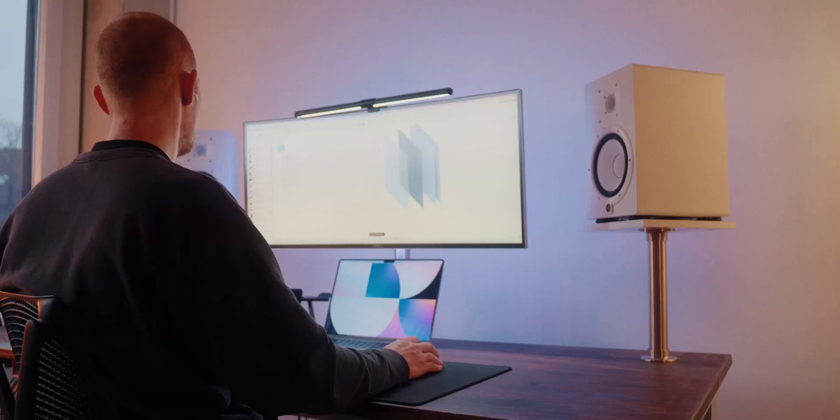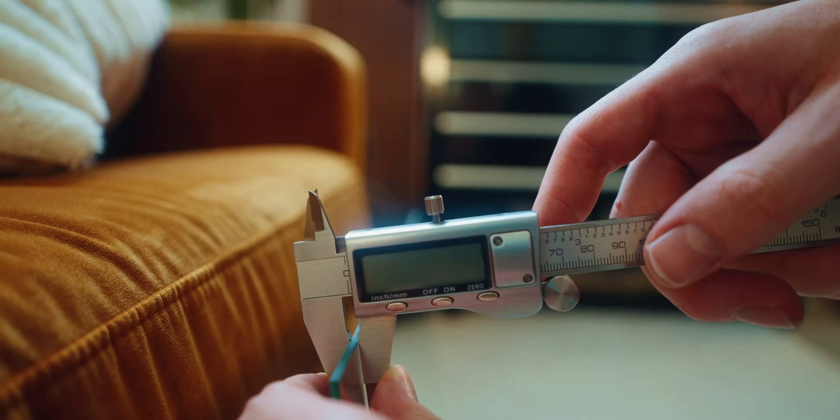So let's get to designing. I'm designing this whole thing in Fusion. First I measured the mirrors that will be on the outside — they are 40 by 40 centimeters and 3 millimeters deep. The problem is that for a perfect cube, every edge would ideally be at a 45 degree angle to join really nicely, and they're not. Also, I only have four of these square mirrors, and for a perfect dice I would need six.